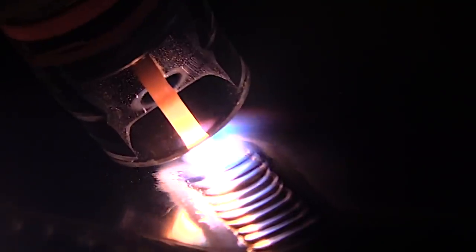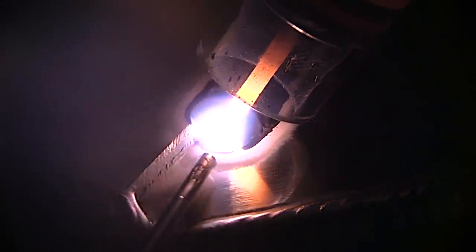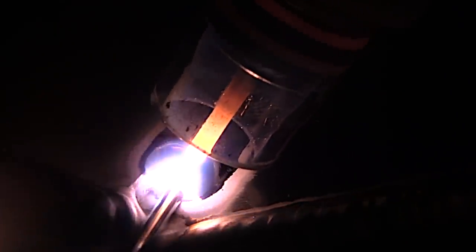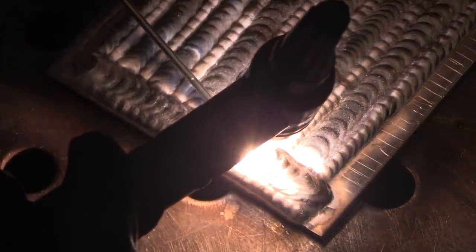I must have shot at least 20 or 25 videos using this cup, so I've got a lot of clips to show you today. This is a lap joint and I'm at about 125 to 140 amps. This is eighth-inch thick aluminum - it had a peel coat on it and I wiped it down with acetone. Clean brand new aluminum is just fun to weld. I'm swirling the arc at the end to try not to leave any crater crack, and noticing a few little pores trying to pop up.